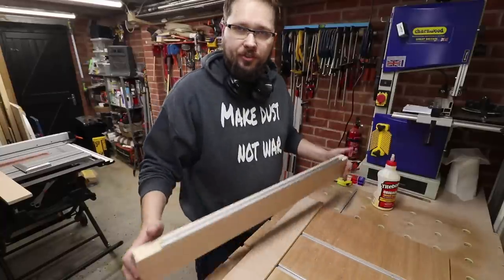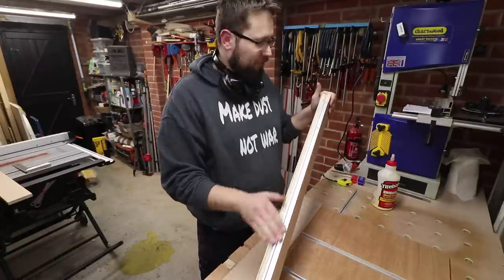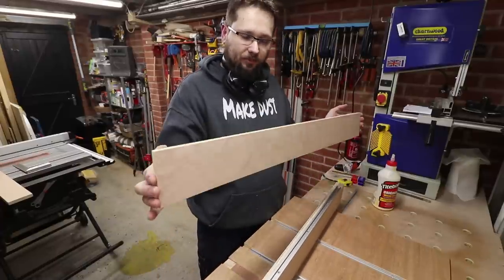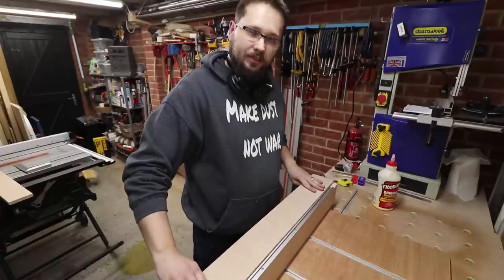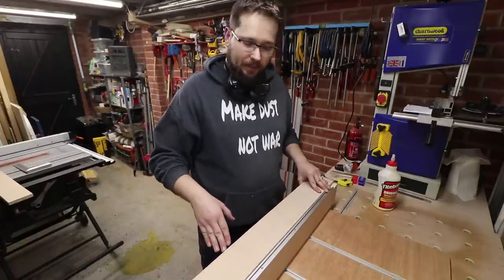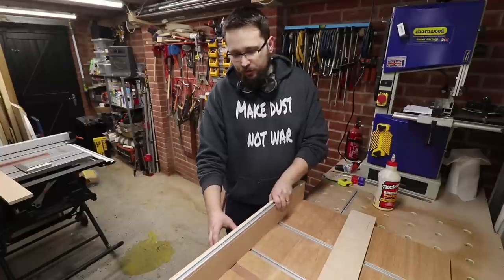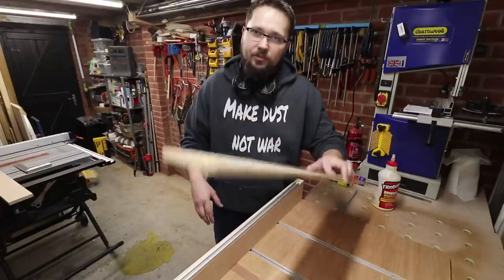Let's introduce the first safety feature for this jig. We've installed the T-track at the front — I didn't have the longer one so I'm missing a little bit on each end, but I did order some more and will replace it with a full-length T-track. I've also got a piece of plywood cut to size that will act as a ledge on top of the fence, so I can push the jig through the table saw with my hands away from the blade area. The second safety feature: when the fence is in place, there will also be a block of wood at the back to prevent the blade sticking out of the jig — basically the blade will bury itself in that block of wood.